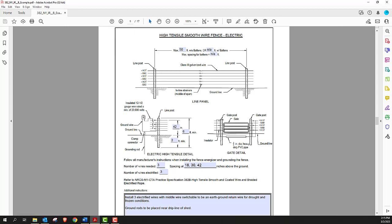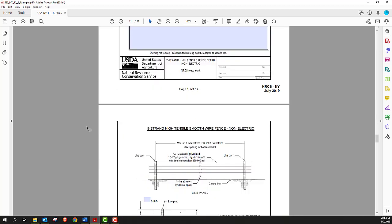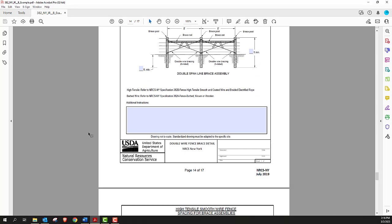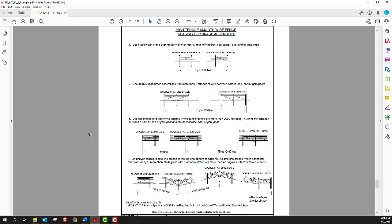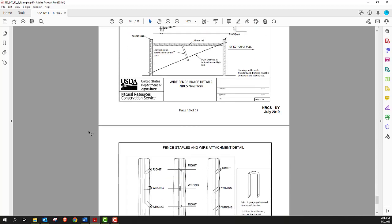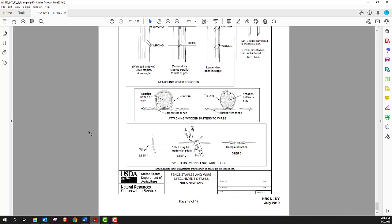The last table suggests a temporary fence setup. The detail sheets have four options — pick the one that fits your project and discard the others. There's one sheet for electric fences and three options for non-electric high tensile wire. After filling in wire information from the tables, there are sheets covering end braces, line braces, brace spacing, instructions for making a brace wire, and instructions for stapling and splicing wire. These last sheets have no fillable fields — they're for reference only. That wraps up the Fence IR. Fence has a 10-year program lifespan, though the actual fences should last much longer.